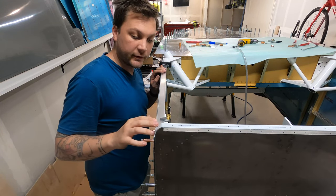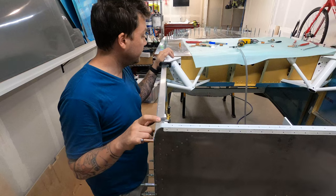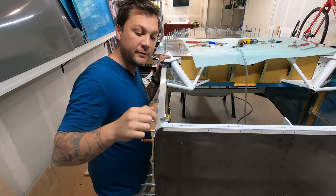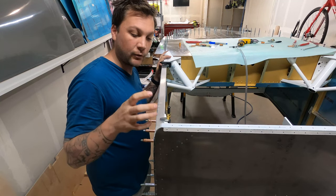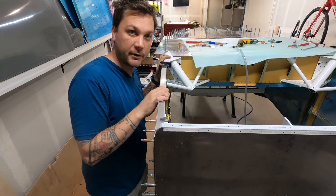I think I'm ready to drill the four bolts that go here. I need a stronger clamp — I have all this clamped together back here. I don't know how necessary that was, but it gives me some peace of mind knowing that everything fits before I make things permanent. Up front, the first thing I'm going to do is mark out where these bolts go, then I've got to tread lightly because I want to ensure that when I poke these holes all the way through, I've got enough edge distance on this bottom part.